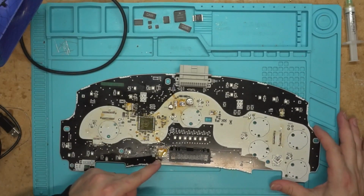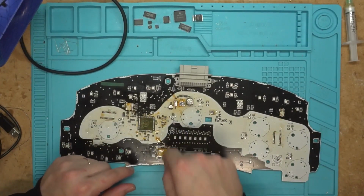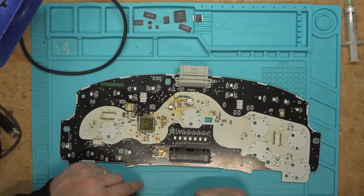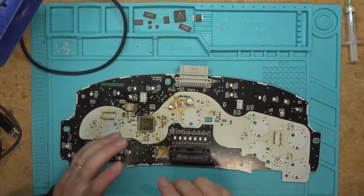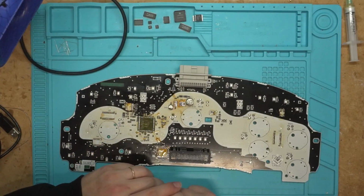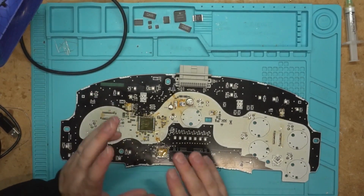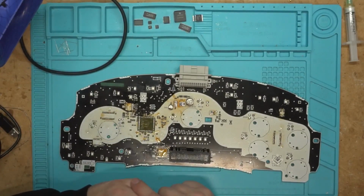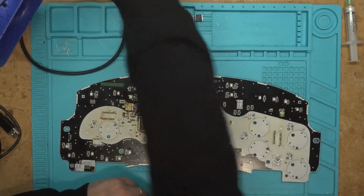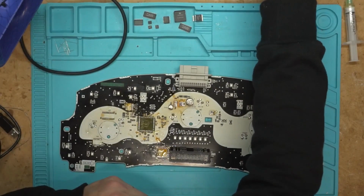Yeah, I struggled to get that one IC off, but that's not its fault. That's really just the fact that you can't get at these legs on this side of it going around it the way it's at. So it took a little bit longer to get that off than I would normally like to take an IC to get off. Everything else came off within the expected amount of time. Didn't turn the whole board brown. That's all just cooked flux that you're seeing. The circuit board itself is still white, so it's not blowing a ton of heat here.